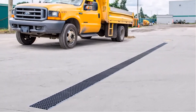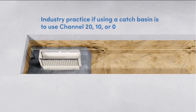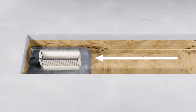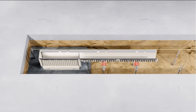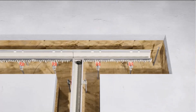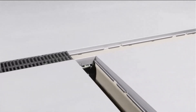Next, we're going to see an animation of a GRP installation — a little bit more sophisticated. GRP is just easier to work with. You install your drain outlets and it's easily modifiable. You've got your catch basin in there that you install first. You've got your level line going across so you know exactly where to position the trench frame, and then it's just a matter of adding sections. These special installation tools — basically a rebar connector — you install on the bottom of the trench. It makes it very easy: you just pound your rebar into the ground and set your sections on top of the rebar. You can level them using the nuts included and then just build your trench across — super easy. Of course it's lighter, so it's easier and safer to work with as well. Once it's all set, you pour your finishing concrete and you are all set to go. Install the grates on top and you've got a finished trench.